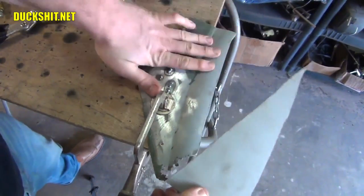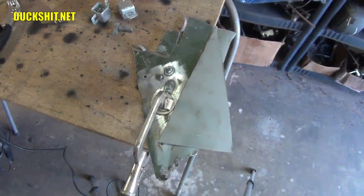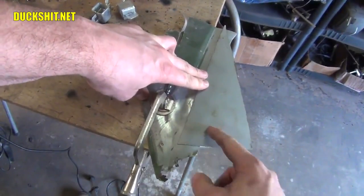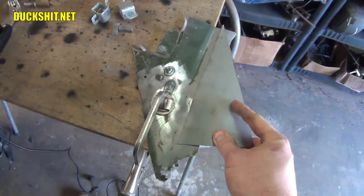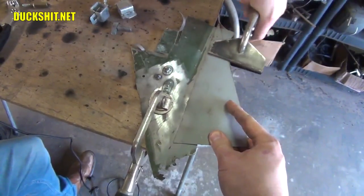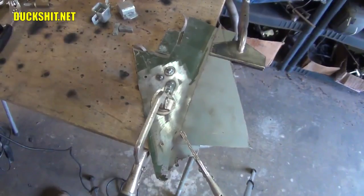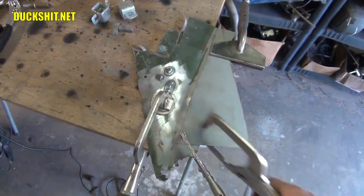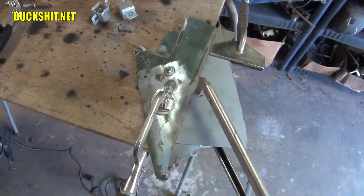Let's just say we've already eyeballed it — this is the car, this is the panel I want to add, and I want to put it approximately right here. When I combine two panels, the minimum overlap you're going to want is probably about half an inch, no matter which size Cleco you use, because you need a little bit of meat on each side. So you'll need to get some type of clamp — a nice flat-jawed clamp should work just fine. I've also got smaller ones, and if you need to reach around a larger contour, there are bigger ones that can reach around a body contour or through a window opening to lock it down.